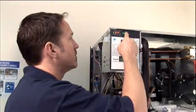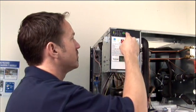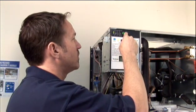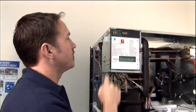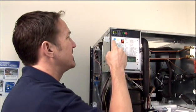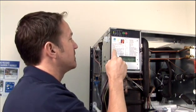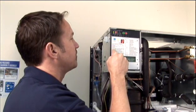At this point, he might want to know if this problem has happened before. He can find that by first pressing the off button for three seconds, and then repeatedly pressing the manual harvest button, which shows in sequence the previous problems. In this case, the recent problems have been slow water fill, shown by repeated code threes.